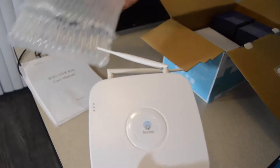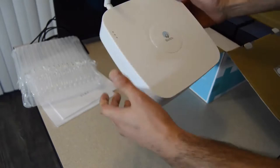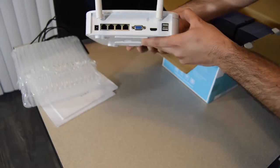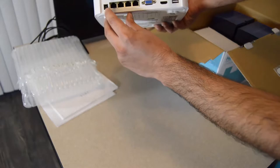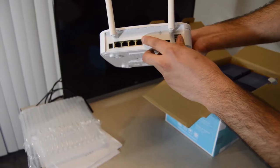The NVR has two antennas. They should be at a 90-degree angle when you install it. On the back you'll see several ports. The first one is for power — it has 12V DC. These ports are for the LAN cable, and this WAN port is the connection for your internet.